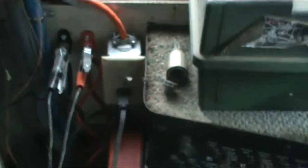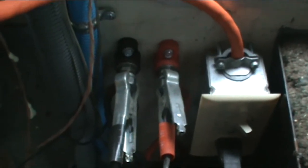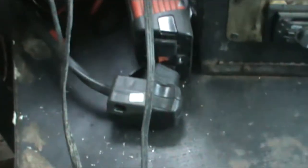The battery charger connects to these terminals here, which go down to the battery downstairs. The inverter is right here, and this is also hooked up to the battery. Of course, we don't want to run both the inverter and the charger at the same time, which is why I have the switch there. The switch for the inverter is right there, and the inverter outlet goes through this cord and comes back over to here — and this is an auto transfer switch down here.